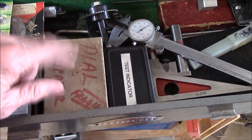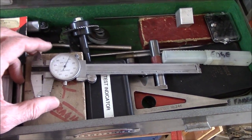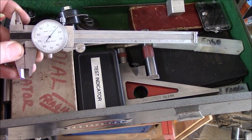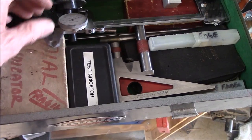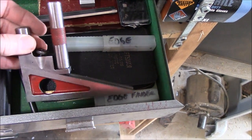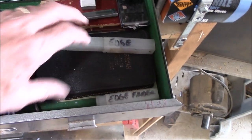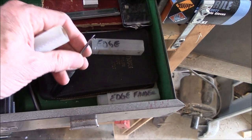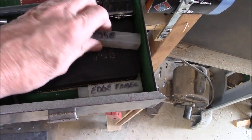These are dial indicators — this is the one that comes in from the back, and this is the one with the little thing sticking out the front for measuring very small. This is the number one tool in the shop. I recommend that you stick with a dial caliper — these are made in China, pretty inexpensive, and very accurate for home shop work. I recommend this so many times over a digital caliper — every time I pick one up, the battery's dead. Down the line for setups, you might want to consider what they call a planer gauge. If you've got a milling machine, you're going to need some type of wiggler to find the center. This one I use all the time — I didn't pay a whole lot for it, it does a great job.